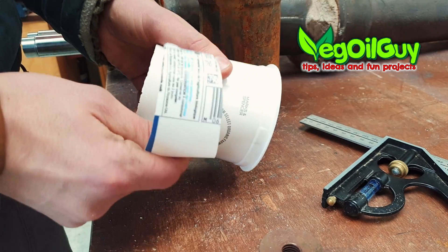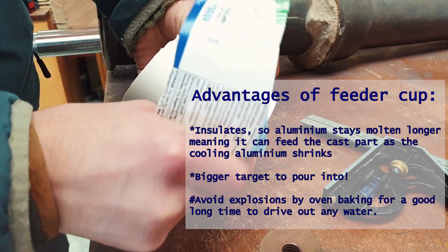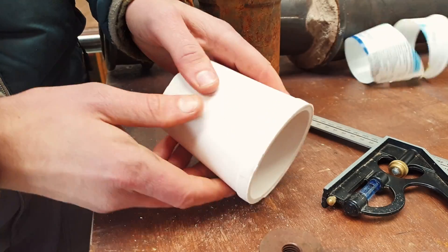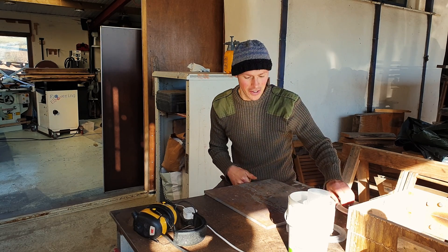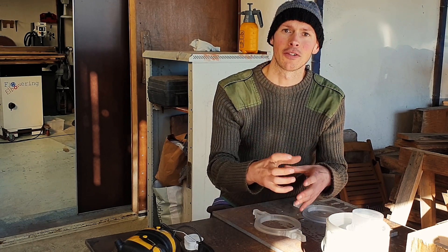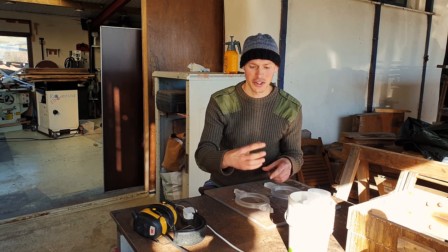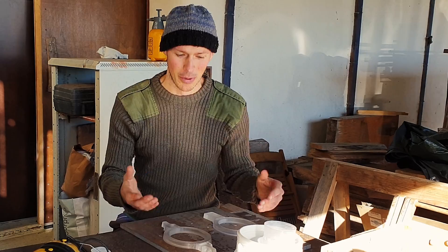Veg oil guy — check out his channel on YouTube, I'll leave a link below. He's got some great ideas, one of which is this feeder cup for the molten aluminium. I'm perverting his idea slightly by using a yogurt pot and a cream pot to create it. So I'm going to put my pattern against the metal plate here. This big plate is going to be like a big heat sink so it'll obviously cool it quickly, and then I've got my feeder cups up above and they should keep the aluminium nice and warm, so ideally that will stay liquid and be continually feeding as it shrinks below and not creating any voids and that kind of thing. But we'll see how we go.